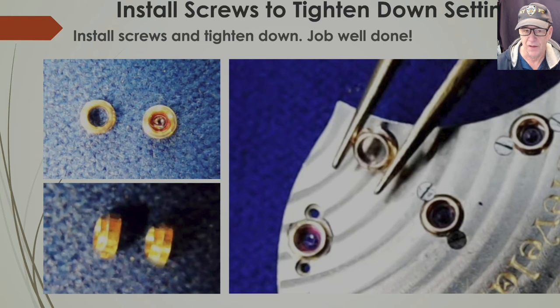Now place the setting in the plate and screw it down. You can see in the picture the old setting in my tweezers and the new setting sitting without screws yet — I believe this was Ed Horn's watch. You can see how close that new setting looks to the existing settings on the plate. From about six to twelve inches away, you cannot tell the difference between the settings. The upper picture on the left shows the old setting with the jewel out, beside it the new setting with the new jewel in, and below you can see the two settings are almost equal. When installed in the watch, you can't tell the difference.